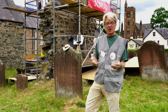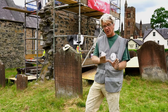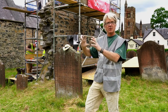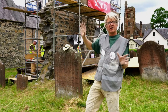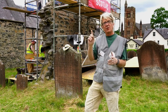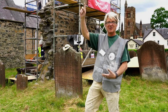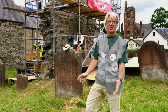So you're using the lime, and you could say the extra lime is helping to make a very good bond, and then over a longer period of time than usually with natural hydraulic limes, that then becomes harder and tougher and more weather resistant. So we've got two different mixes on the same structure, but that's how you would work historically. One mortar cannot do everything, and if you have a mortar that can do everything, it's a mortar you shouldn't have in most of your building, because the reason it can do everything on the top of a chimney is that it's not breathable enough to keep your building dry. So yeah, that's the principle there.